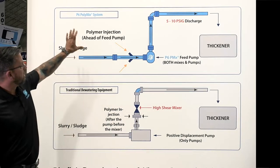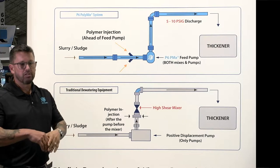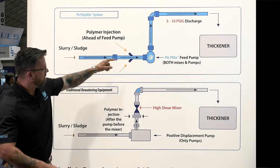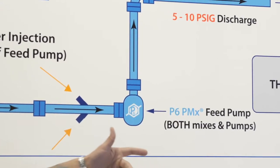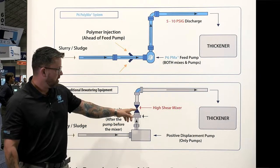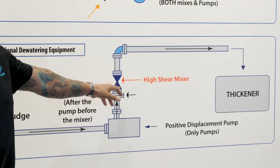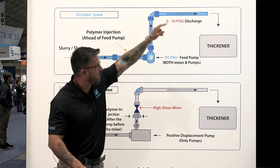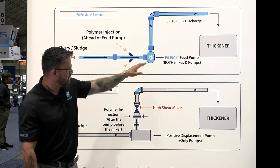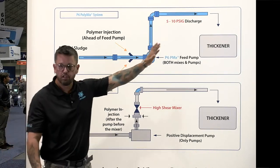What we've done is taken the P6 method and inject the polymer directly into the pump. The boundary layer viscous drag principle is very gentle with shear-sensitive material and works to mix the product with the polymer together. The pump itself does the mixing, so we eliminate the high shear mixing valve and feed the press at less back pressure. With say 400 gallons per minute going into a belt filter press, you could have 25 to 40 psi on that valve — that goes away. We're not beating up the floc with the pump. Customers typically see a 20 to 50 percent reduction in polymer consumption needed to get dry cake on the back end.